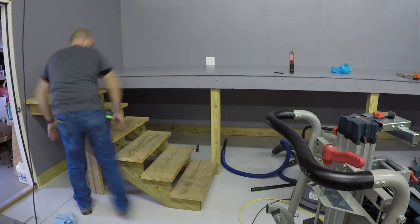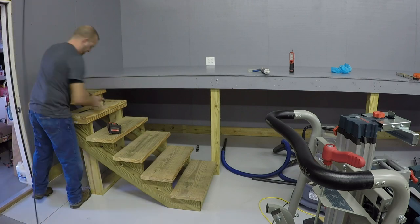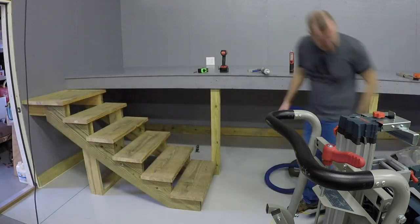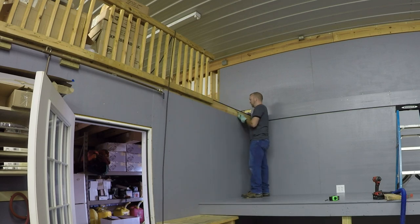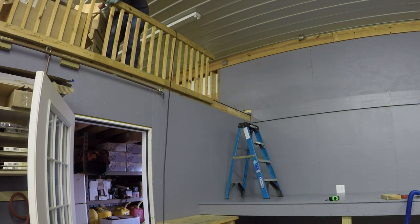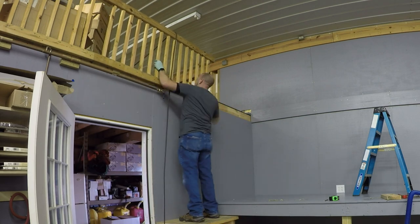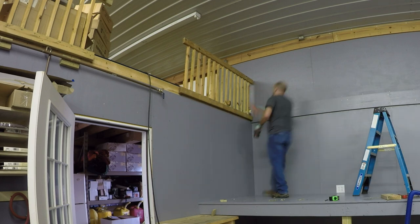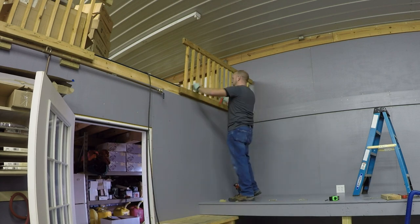I'm using the same steps I built for the mezzanine when it was on the other side of the shop — and I got lucky here. The man door to the office has been in this location since that office was built, and I have just enough room for the mezzanine and the stairs while having them both at the sizes I wanted. In this corner I previously had a ladder to get up on top of the office — it was used for storage and the kids also used to play up there, hence the railing. There's no reason to leave that gap so I'll move the railing all the way down against the wall. I have a 1x4 spacer block between some of the balusters.